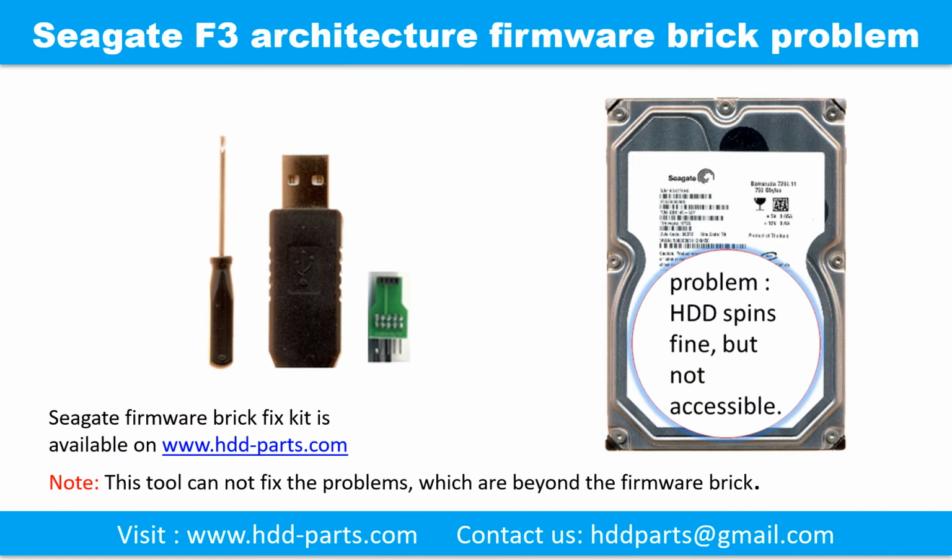Firmware break is a commonly known problem in Seagate F3 architecture hard drives. The symptom is that the hard drive spins fine, but is not accessible by any computer. We designed a special kit to fix this problem. The kit is available on www.hdd-parts.com. Please note, this tool cannot fix problems which are beyond the firmware break.